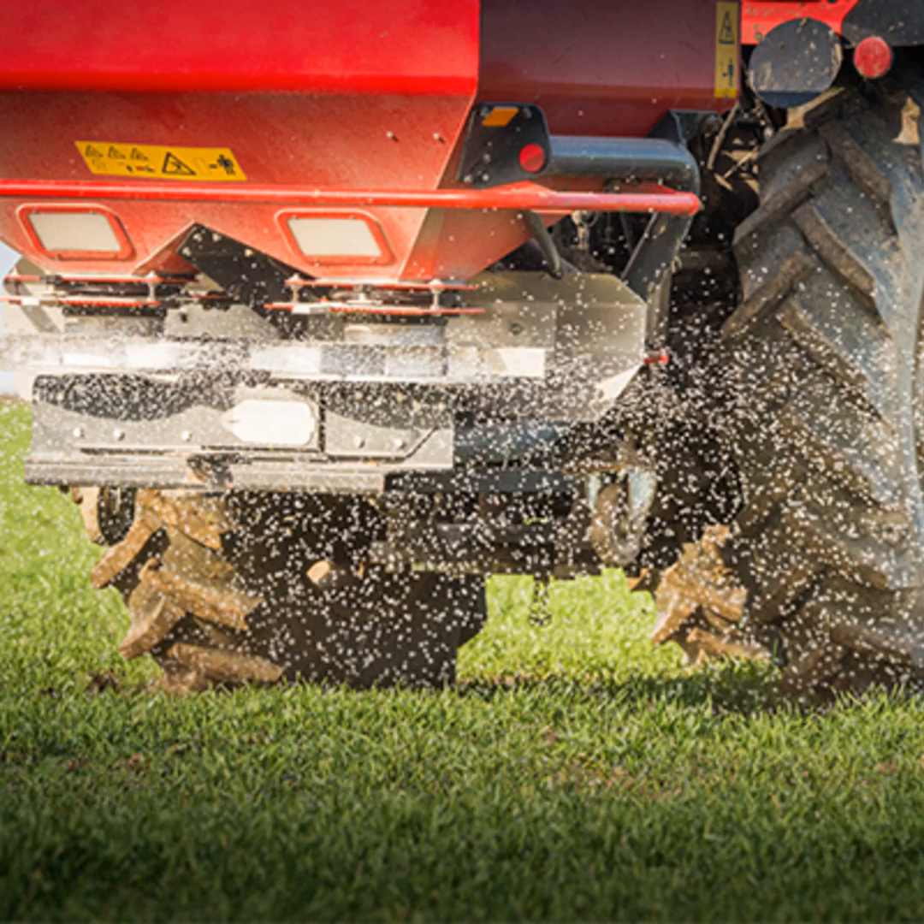That is the basis, but if you don't have that right, we're off to a bad start. The other thing is the simple open and close — making sure everything is free and easy moving. The regulator, depending on the spreader, may have left and right or just one linkage, but normally it goes through two or three linkages back to the ram or a lever, and you will tend to have wear in those over time.